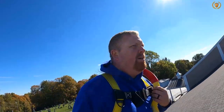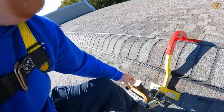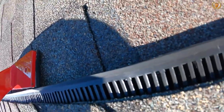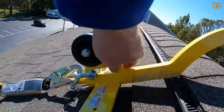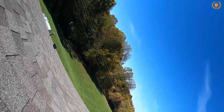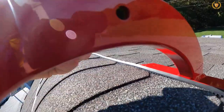We want to make sure we're safe up on the roof — we don't want to fall down. So we do have the ridge pro here. You can see it has some pins and angles on it. Right now you can see that this thing is set on a 9/12, but a 10 is pitching it up too much — an 8 is where we need to be at.